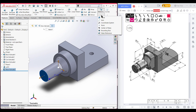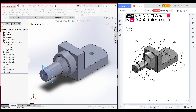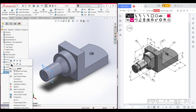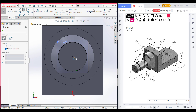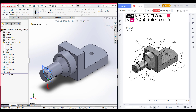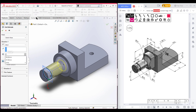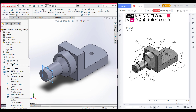Select this face, select a reference plane of 11 units distance, and flip the offset to reverse the plane. Press okay. Select this plane, sketch, now normal to it. Select this circle face and use convert entities — we need to draw an outer circle of 28 diameter. Then select the circle tool, place the circle at the previous circle origin center line, and draw a circle of 25 diameter. Go to features, extrude cut it to 3 units. This extrude cut has been done. Hide this plane, we don't need it anymore.